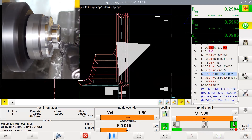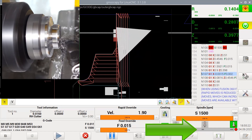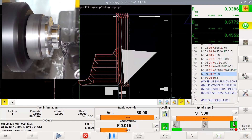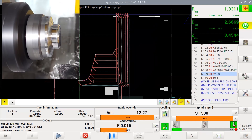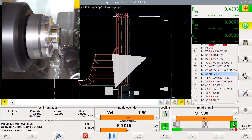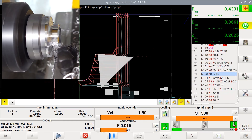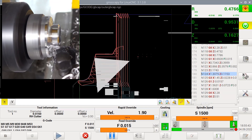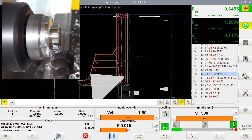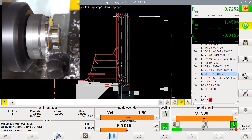The displayed spindle RPM is not the same as the requested spindle RPM. We're running at 900 RPM, not 1500, because I don't have a VFD and this is a belt drive system. However, I'm using G95 for the feeds — feeds per rotation — regardless of the actual RPM, so it comes out the same. It's just a case of how fast to go to make the tool happy. I also dropped my feed from 20 thou per turn to 15 thou per turn because that seemed to work better.